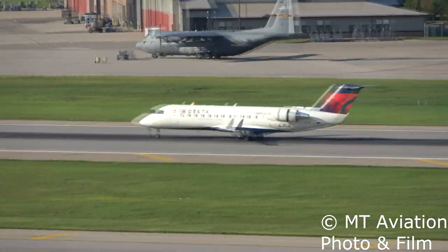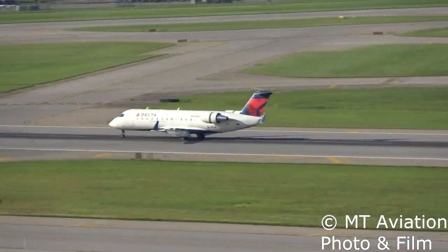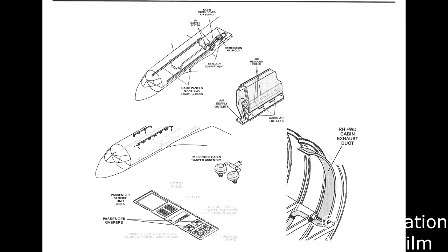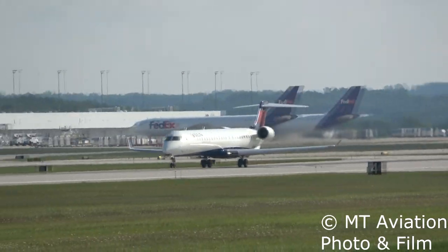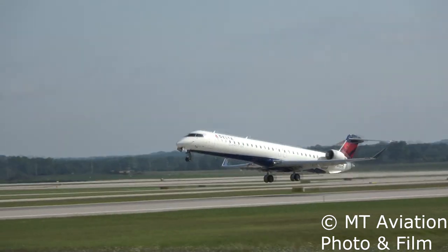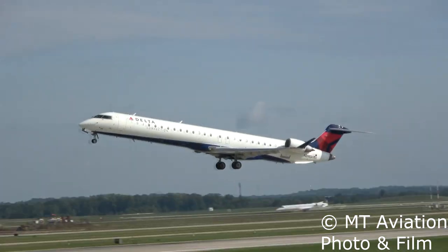The CRJ-200 does not use any type of cabin air recirculation. Because of the outflow valves we discussed earlier, there is a constant flow of air in the cabin. As conditioned air comes through the dado panels at the floor level and through the gaspers above the seats, the old air is routed under the floor and used to cool avionics computers in the compartment below the cabin floor before exiting the aircraft through the outflow valves. So the air in the 200 is constantly being changed and not pumped back into the cabin, and therefore there is no need for a HEPA filter.